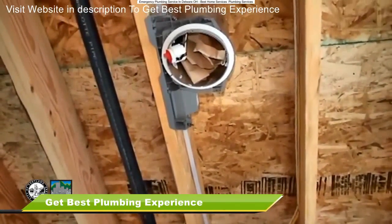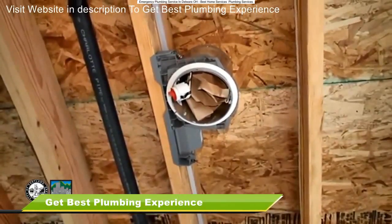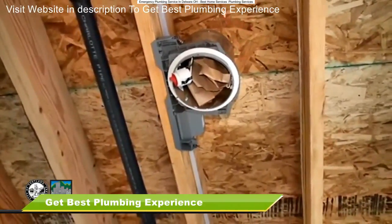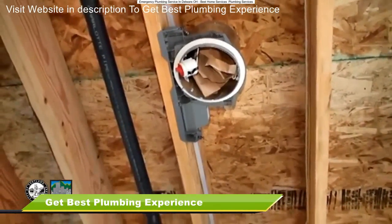As you can see here, the PEX pipe runs behind the can light. Aquapex requires a 12-inch clearance between the recessed lighting and the Aquapex piping, because this creates heat, so we want that clearance to be there.